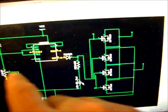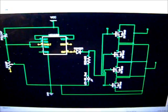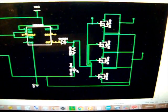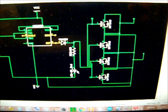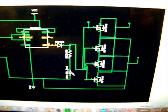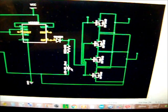I modified the circuit by adding a variable resistor so I could adjust the time, and I changed the capacitor value so the delay on time, the delay at the beginning when it first receives power, could be a maximum of 1 second. As the pendulum swings down and engages the contact switch or Hall effect sensor, I can adjust the timing to allow the magnet to pass the electromagnet, and then turn on the electromagnet so it doesn't impede its progress, so it gives it a little push at the right time.